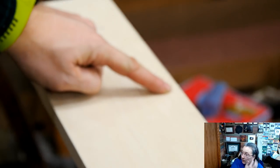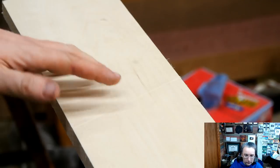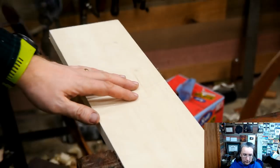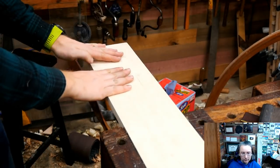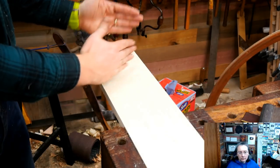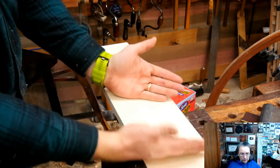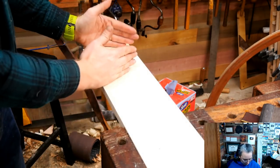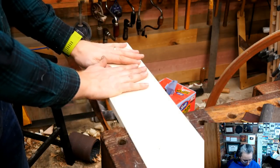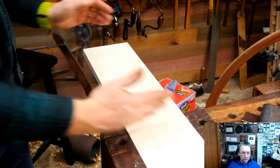Brian Ross wants to know what side of the line do you cut for this angled cut. So this is the piece I'm working on — the first end cap. I'm going to make this little cut here and this little cut here, cutting on the outsides. Then I'm going to take this piece, flip it upside down, and mark my other one. So I'm cutting on the outside of the lines — on the outsides of what I want to keep for this piece.